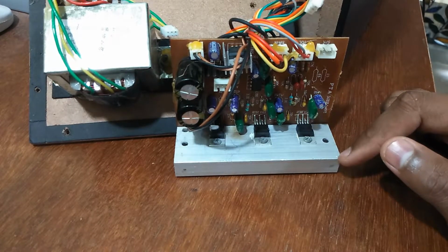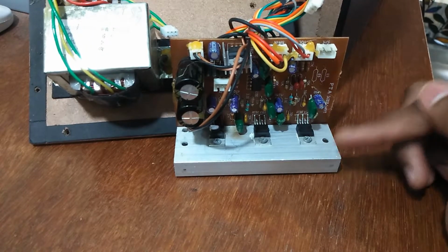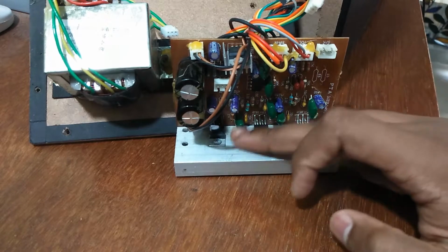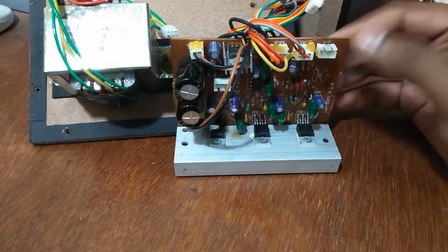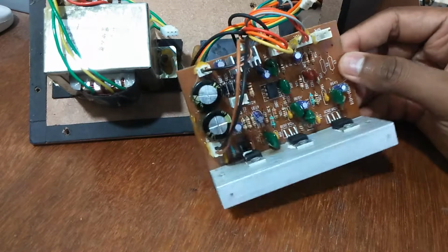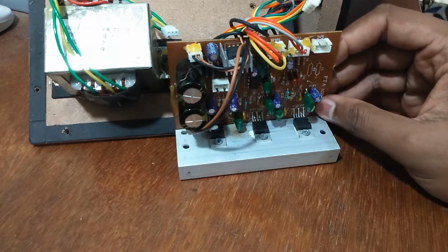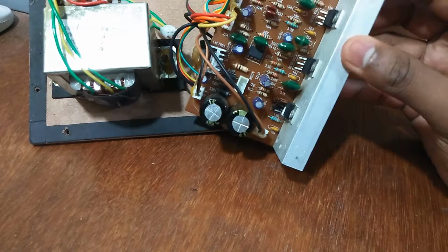And looking from the output ports that we just saw, I thought it should have at least 6 channels, but that doesn't seem to be the case. It has 3 channels. So what I'm assuming here is this is the left, this is the right, and this is the subwoofer, and that is how these 3 amplifiers are distributed. And it's, I think, a simple board. It is based out of TDA 2030. It's a fairly simple IC. I think you can find it on Amazon, and I'll link the datasheet for this IC in the description. But then it's a fairly simple board. I don't see much here.